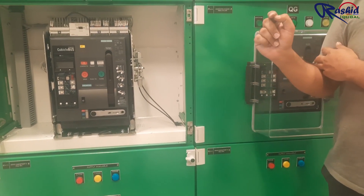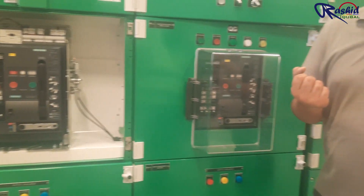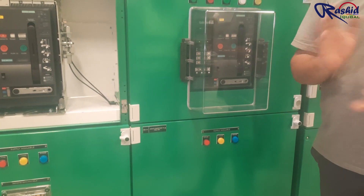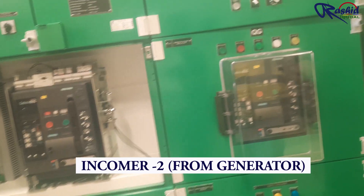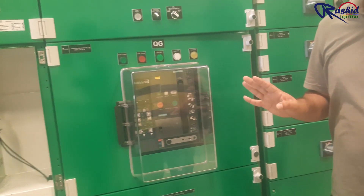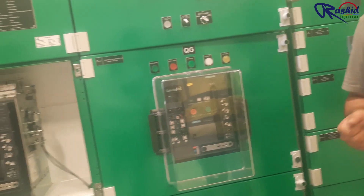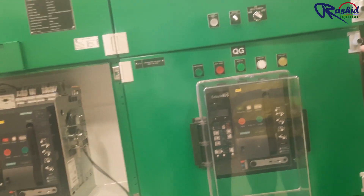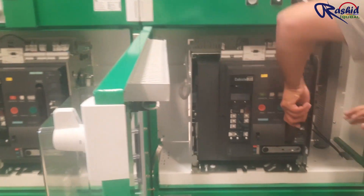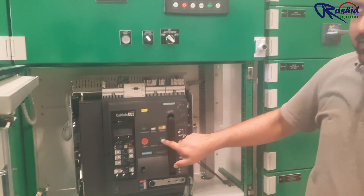This was the mechanical operation for the breaker. For safety, we also have a mechanical interlock between these two breakers. Because once the mains is on, the generator breaker should not close — and if the generator breaker is also closed there would be a problem. Electrically, this protection is provided by the ATS: the automatic transfer switch will not allow the generator breaker to close if the main breaker is closed, even in manual mode or bypass.